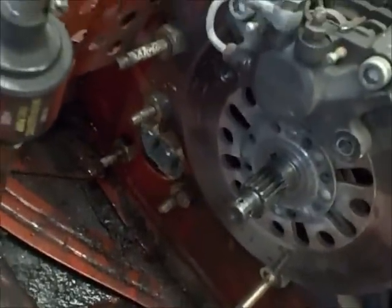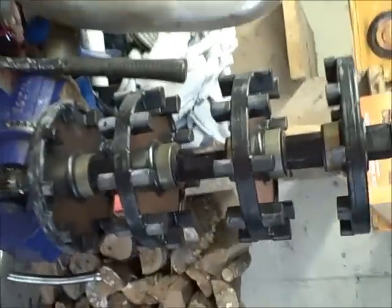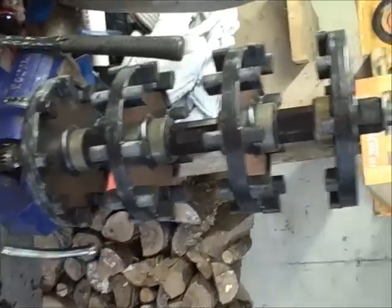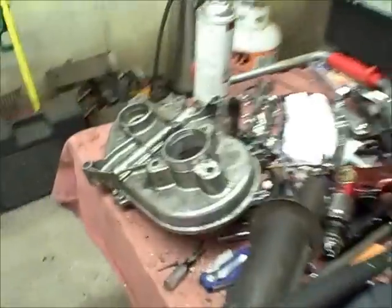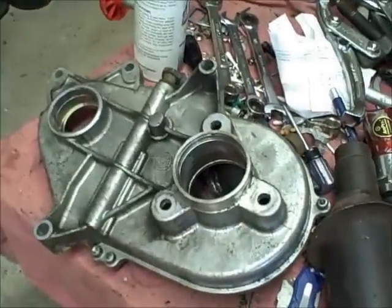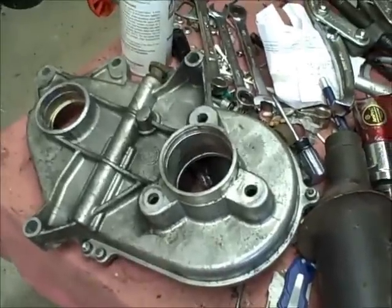On this side I took the whole drive axle out. In order to get the track out you have to take this drive axle out. Those are all the sprockets that move the track. I've got to replace the bearing that goes on the end of this because that was spent.